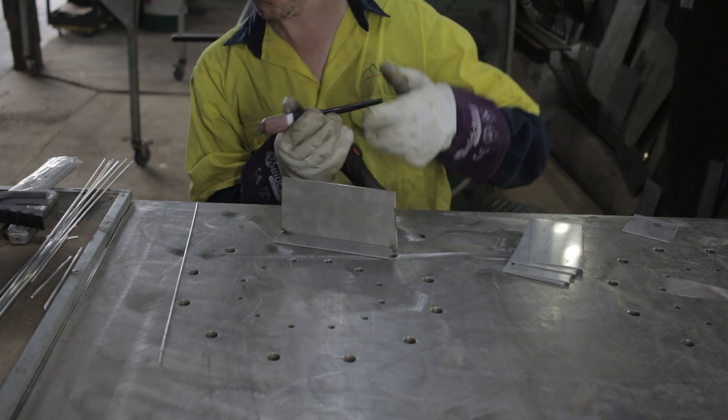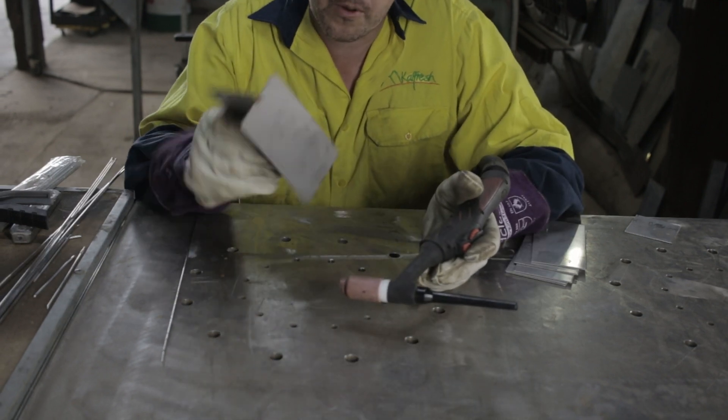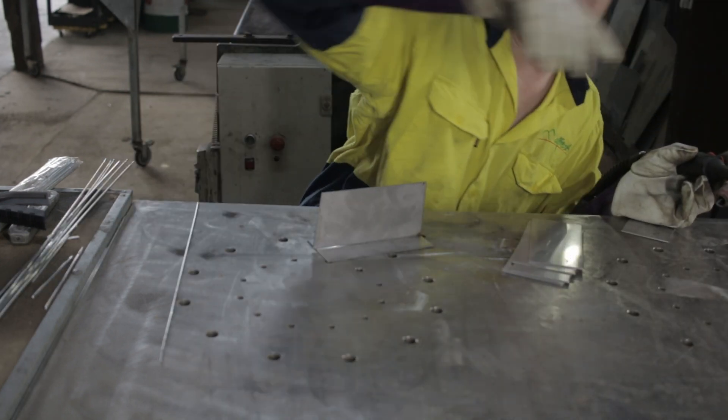AC — that balled the tip because it was AC. So that was probably a great example of: check the settings of your welder before you start. DC TIG, that'll be better.